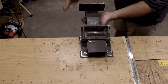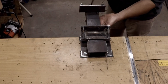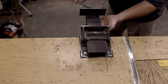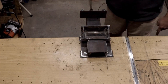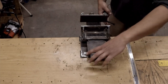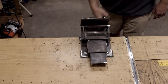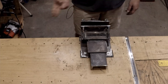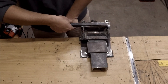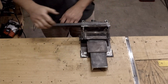You can make this much stronger with a thicker threaded rod and bigger pieces of metal, but for my purposes this is more than sufficient. It's a fairly coarse thread threaded rod so it moves fairly quickly — a finer thread would move much slower for the same number of turns. It's got a bit of play just so it doesn't stick, but the two jaws come together quite strongly. I'm going to bring them closer together, take a piece of square iron, clamp it — and I'm moving the entire table and this is not going anywhere.